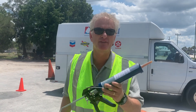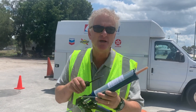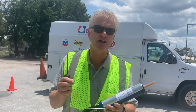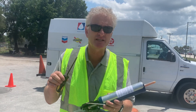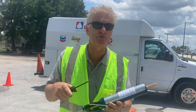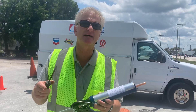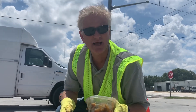Just to review the characteristics of the Steel Camel AquaBlock gel: it comes in this tube, you get about two to three spill bucket rims per tube, and it spreads easy. Put the lid on — there may be a little vacuum seal at times, but you can just pop the lid off with a screwdriver. It's very easy to clean up; any excess you just move around with a gloved finger. It lasts about 30 to 45 days depending on how much rain you get and how many deliveries you receive.